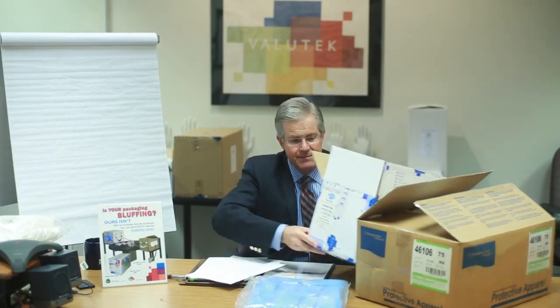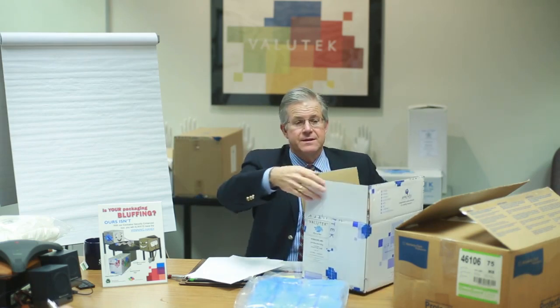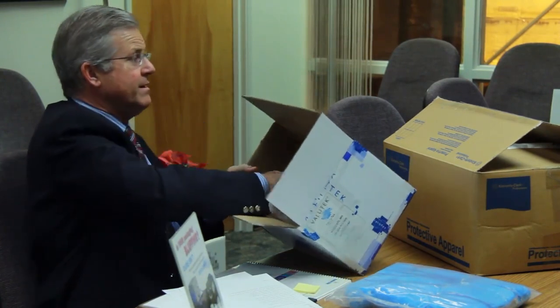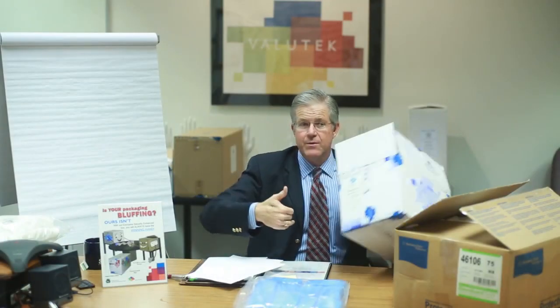So to summarize: when we ask 'is your package bluffing,' the first thing we're talking about is the outside — are there visual cues to indicate suitability of use? Does the product have anti-counterfeiting tape, making it difficult to counterfeit? Is the corrugated lined with a poly liner to prevent cross-contamination? And when you get to the inside, is the product flat packed and vacuum packed in a way to ensure you can get it from the receiving dock through the pass-through into the gown room without contaminating? Packaging really does matter. It can give a visual indicator of appropriateness of use and ensure you can load your product into the gown room without creating contamination.